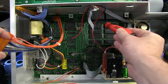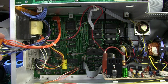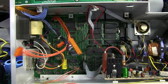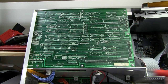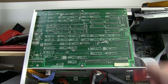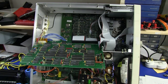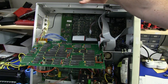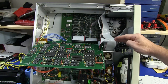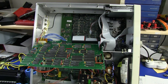Here are our two main ribbon cables going off to our main logic board on the other side — they call it an ECL board. So I was right about the ECL logic. We've got our ECL board and then the processing board up the top. The logic board here has folded out. As you can see, there's a lot of wasted room — this case is maybe 150 millimetres high and there's a lot of spare room. They really could have made the instrument half the size, stacked the boards with vertical PCB standoffs. But when you're designing scientific instruments, size really doesn't matter — the bigger the better, the more impressive it looks.